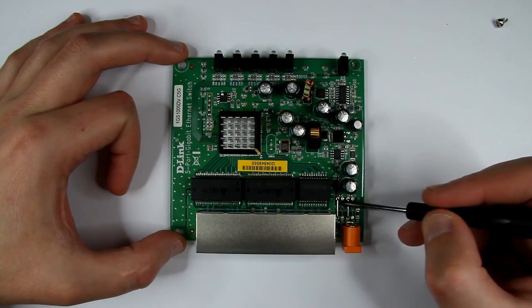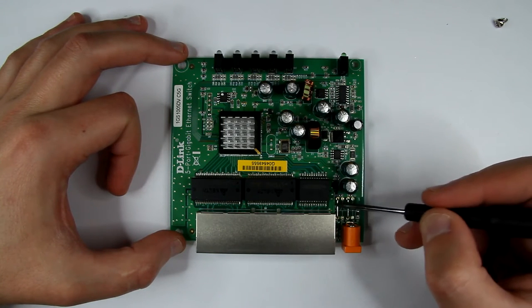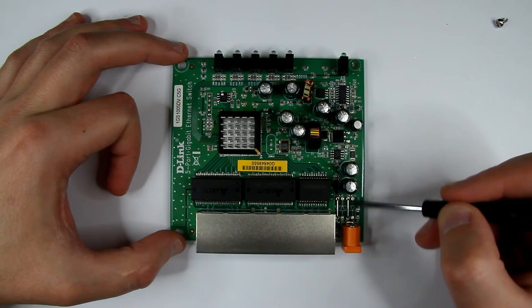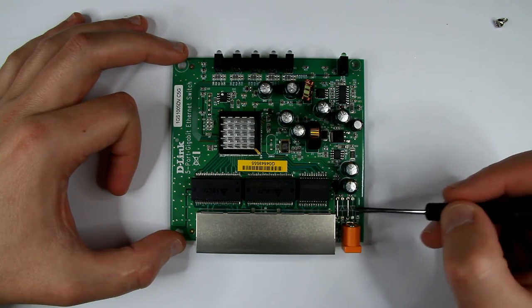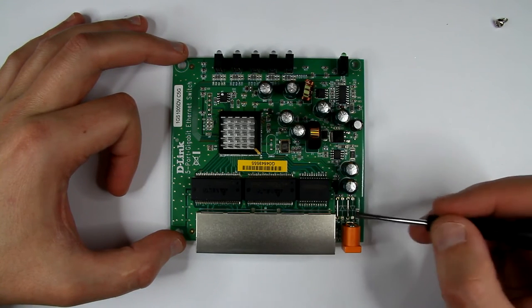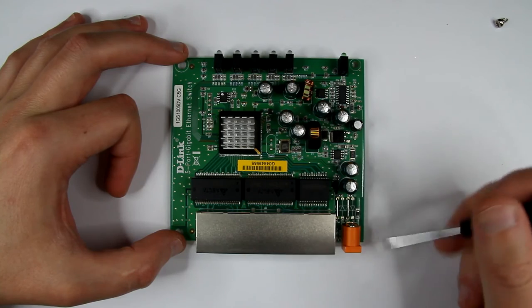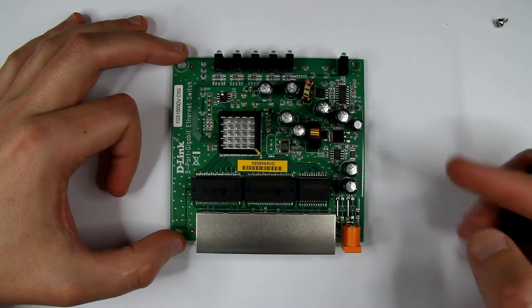Oh, interesting. So this is supposed to be a diode bridge, but it looks like they just threw in some jumpers. Like, who cares? What if somebody plugs in AC or, I don't know, reverse polarity stuff. So yeah, it's gonna bust all the circuits here.